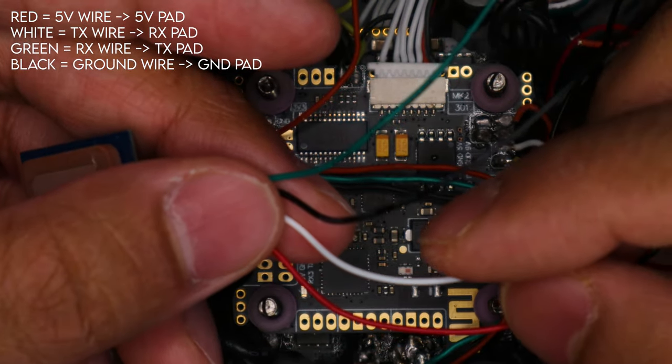For this next part, plug in your battery and turn on your controller. You'll also want to set up a switch for the GPS Rescue function on your Taranis or whatever radio you have — set up the switch inside the radio first. I can make a separate video on that later in my Introduction to FPV series. If you don't know how to do that, I'll link a video in the description. Once you're done with that, come back here and continue.